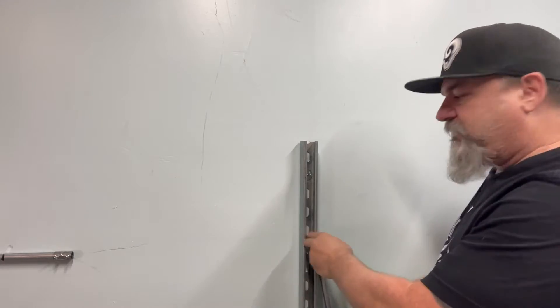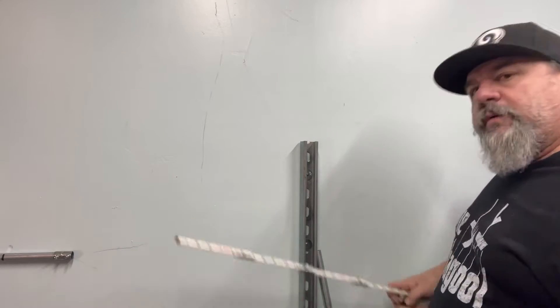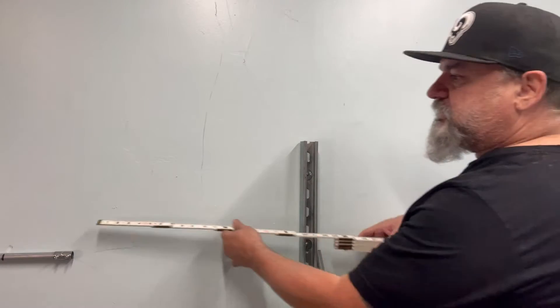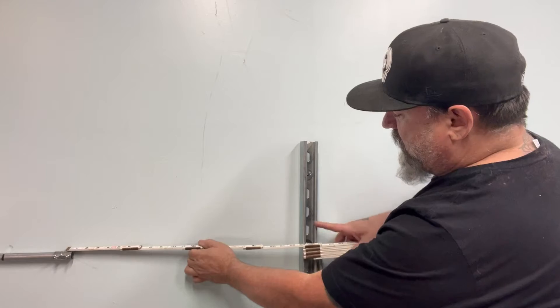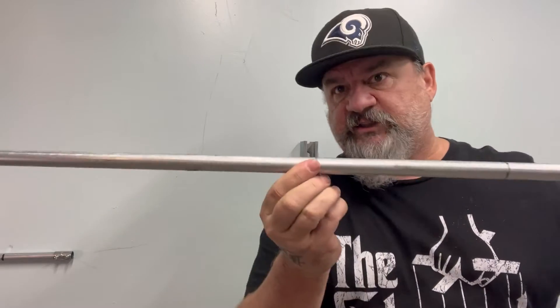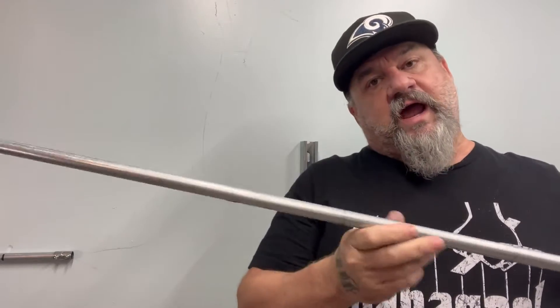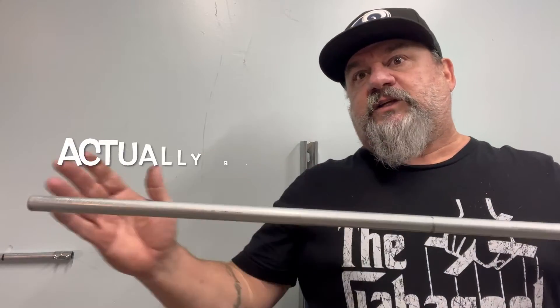We want to do a three-point saddle. If we had multiple pipes, we'd do a four-point because a four-point saddle is a lot wider. So we'll do a three-point saddle to get right around that and continue on. We take our measurement from the center of the coupling to the center of whatever we've got to get around. In this case, it's 24 inches.